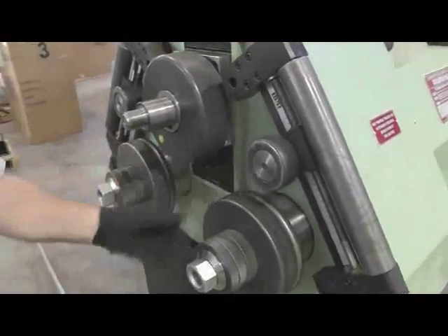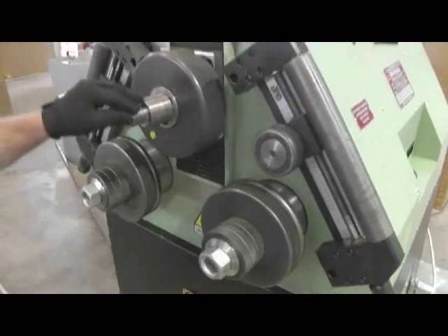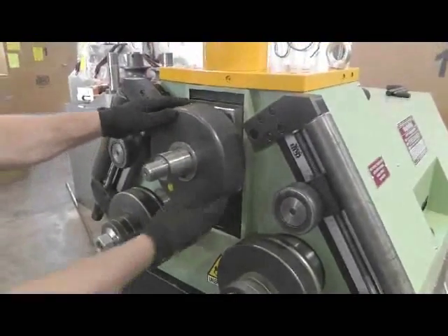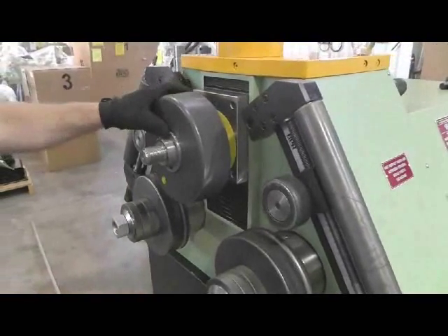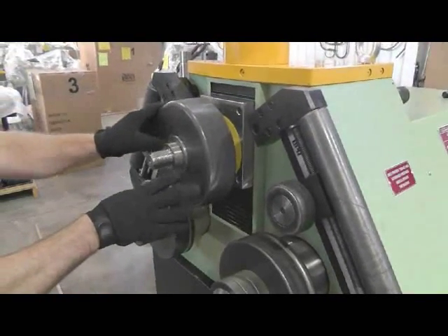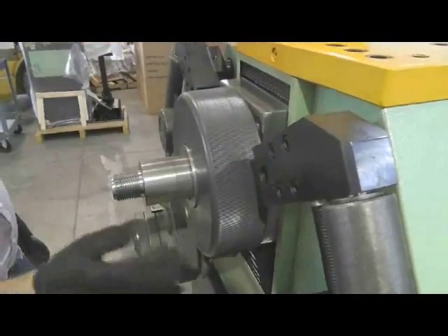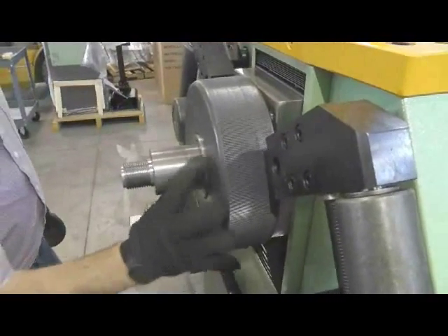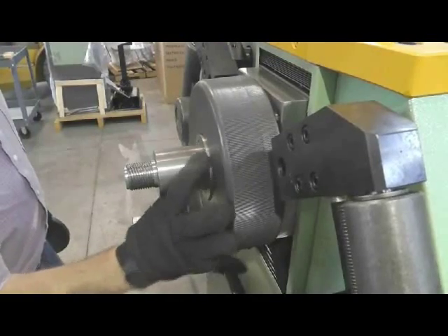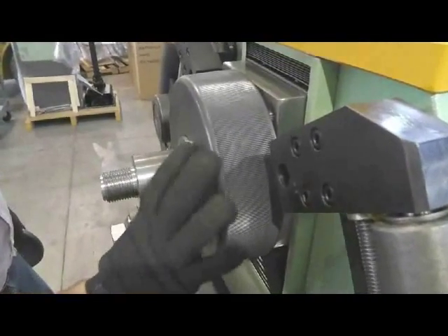I have the small core spacer behind that, and then I'm filling out the rest of the shaft. On the center roll or top roll, this is one of the optional tooling for rolling angle. This actually comes in a set of two. When we roll angle leg in, we'll use one of the rolls on top. This has an adjustment for the thickness of the angle. There's an adjustable washer on the inner portion of the tooling so you can adjust for the thickness of the angle.